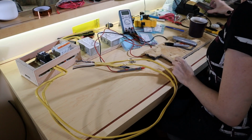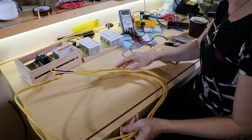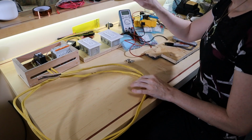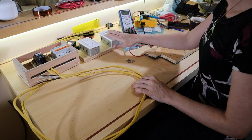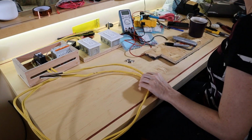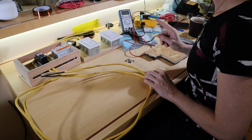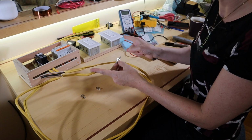And there we go. While I was filing back those ring terminals, I had a thunk. It hurt a little, but that's okay. I've got two AC outputs, and my whole purpose of this stage of the project is to learn the Quattro. So I'm going to run one to AC output 1 and the other one to AC output 2 from the Quattro. If I've got it right, AC output 1 will continue to provide power so long as there is batteries. AC out 2 shuts off when shore power is lost or generator is lost, but no generator in this case. I am going to print some labels to mark AC1, AC2, same thing on the breakers, and then we'll crimp these up and we'll get them mounted. Though, now that I've said that, that means, oh bollocks, the two neutrals have to have their other side filed off, because now I'm going to have a hot on either side.